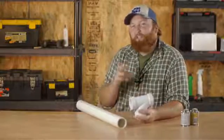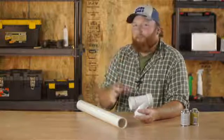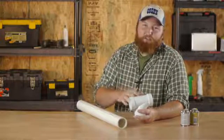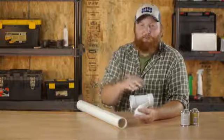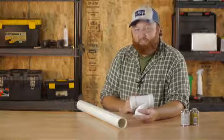The most common place that you want to put a T-fitting in your vents is actually on the outside of the house. Usually they vent your toilets and all your sewer lines through the roof. A lot of people like to put a T up there so that way snow and rain cannot wash down into your vents.